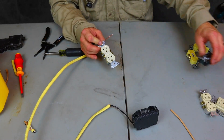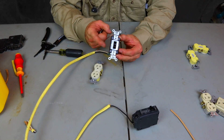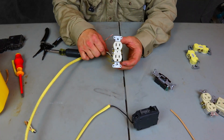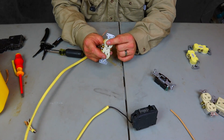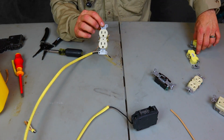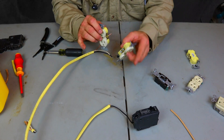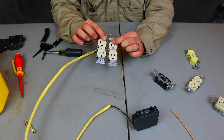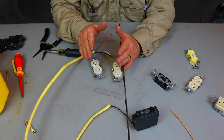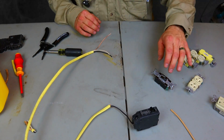They're all labeled, and switches are the same thing — they're still a device. If a switch is the only thing on a 20 amp / 12 gauge circuit, you'd have to put a 20 amp switch. But if you daisy-chain two or more 15 amp receptacles on that 12 gauge wire, now you can legally run those on the 20 amp breaker. It sounds weird, but that is the code — plain and simple.